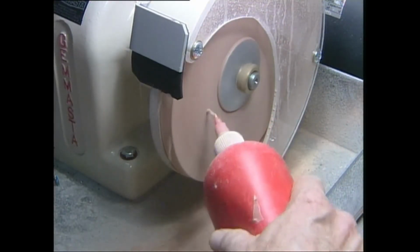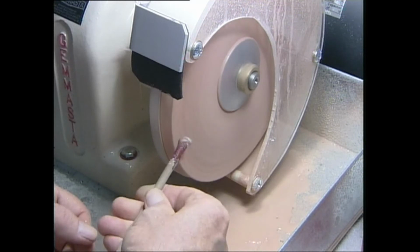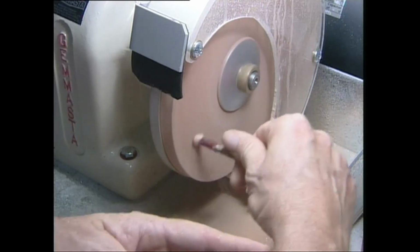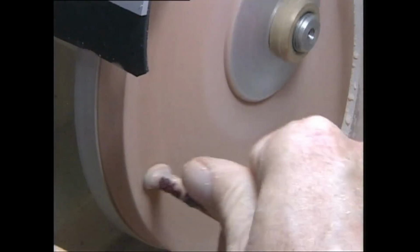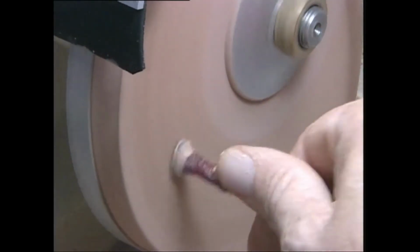Now with the polishing here, make sure the wheel is very wet. It also will drag, being a felt buff. And again, start on the edge of the stone and work your way up to the centre of the dome. Spinning and oscillating. You see I support my right hand with a couple of fingers of my left hand here. And do whatever makes life easier for you or more comfortable. Working the entire surface area of this stone, make sure that the wheel is wet. Don't let it dry out. We can see polishing powder here going up over the stone onto the stick, so the wheel isn't very dry at this point. Well, no, it isn't too dry.